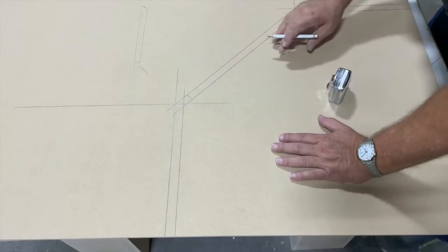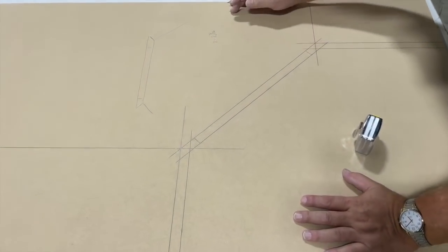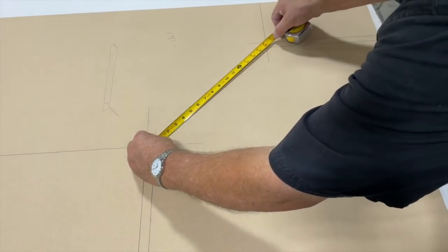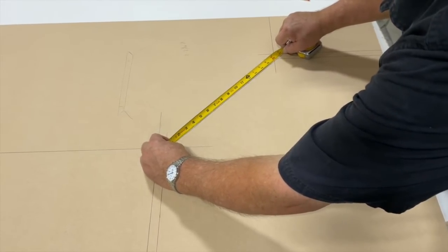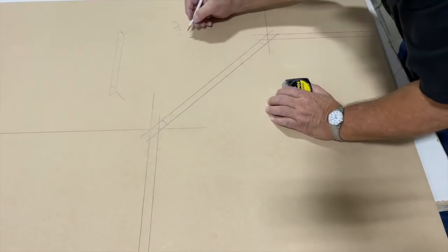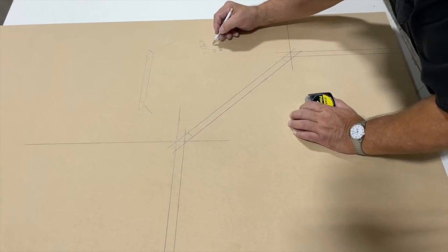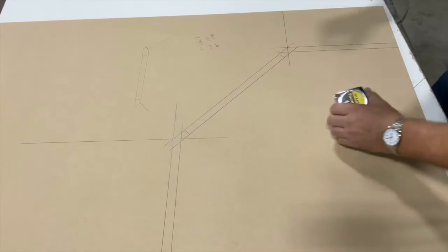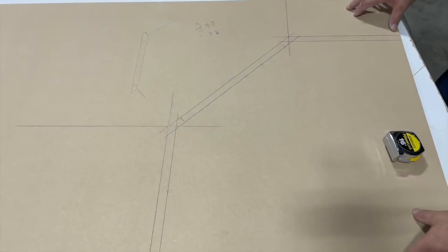And so as I would be listing my face frame, I would put 2 3/16 by the height of the cabinet. There's my 2 3/16. Now, my measurement for my rails, top and bottom, will be 14. I burn an inch right there, put it on my mark, and it's 14 1/8. So I've got to have a top rail and a bottom rail that are 14 1/8 by whatever the thickness of my rail needs to be. There is the beginnings of my layout for my corner cabinet.